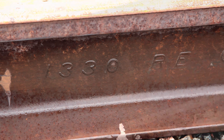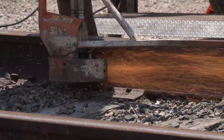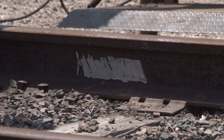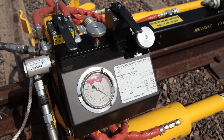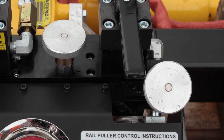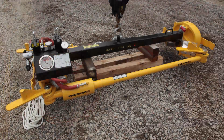When raised letters or numbers on the rail cannot be avoided, grind those areas so the jaws make full contact with the web of the rail — conditions like these may cause the rail puller to slip. Now let's take a look at the intensifier unit and ensure its maintenance and operability. Clean all intensifier surfaces, lubricate the lock valve and the speed valve, and replace any missing or damaged decals. It is critical to perform an overall visual inspection of the rail puller. Items to look for are cracked or leaking fittings, worn hoses, or loose bolts.